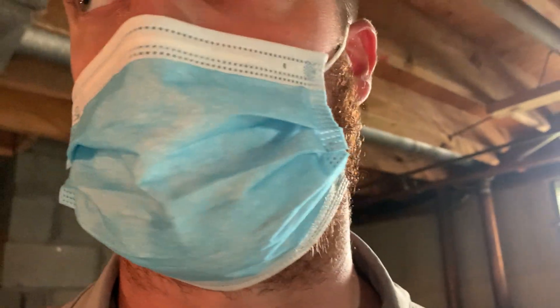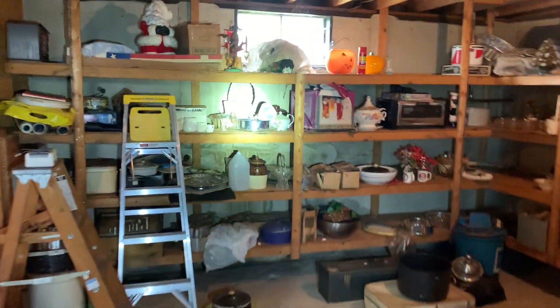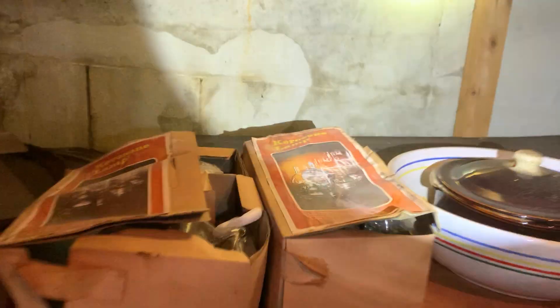I'm in a basement today doing a home inspection with a poured concrete foundation wall. I want to show you a couple things I see on pretty much every poured concrete foundation wall. If you flip the camera, you can see this line here in the concrete — it's a different color. You can see it continuing around here and over here. This is actually a cold joint, and you can see water penetration right along that line.